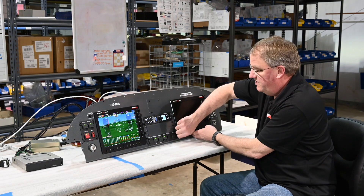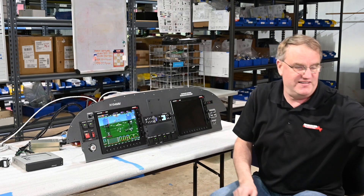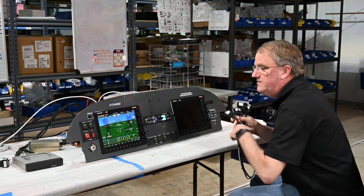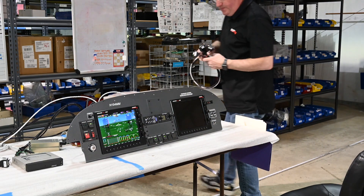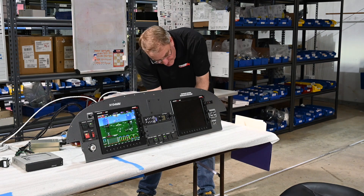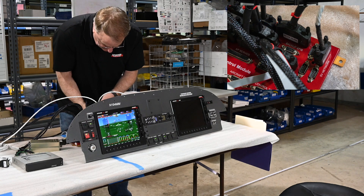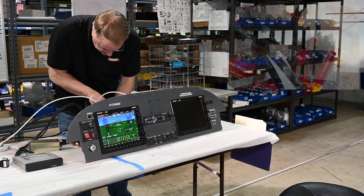Now mounting is the easy part. With a traditional panel you'd have a whole lot of wiring to do, but not with our system. We give you pre-made harnesses in different lengths for different configurations. So let's turn off the avionics switch — that turns off the power so we don't plug anything in with the power on. We're going to plug in the pre-made harness for the MFD here. This end then plugs into the ACM main connector, and then the Skyview network plugs in here. That easy.